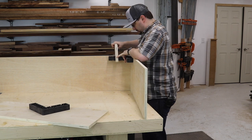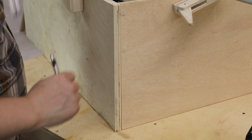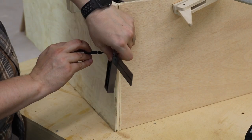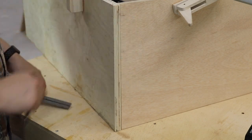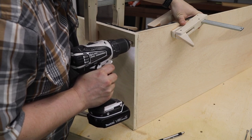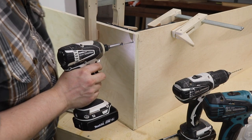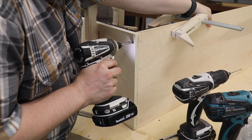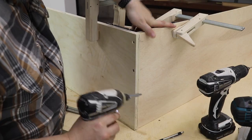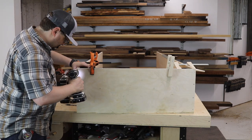I've got one corner clamped down, came in and drew a line an inch and four and a half inches down, then drew a line roughly halfway across the width of this three-quarter inch piece of plywood. I'm going to drill a hole into each one of these spots. Starting with the top, I'll drill a hole, sink a screw so this stays nice and square. Then I'll come down, square up the next one, drill a hole, countersink it, drive in a screw, and work my way down.